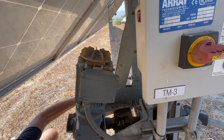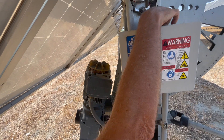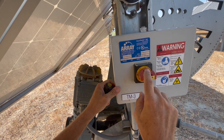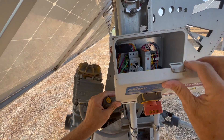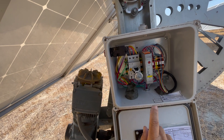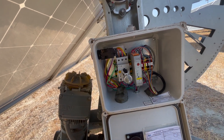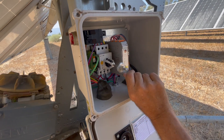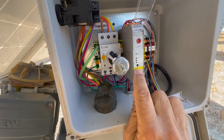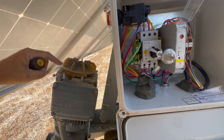So I'll leave that off. If it was amber, and if this was a stalled tracker, the next step would be to open this cover because there are some little controls inside here. It's one clip at the top and it will only open when it's turned off, so you just pop that open. This is the off-on switch right here, and in order to do this reset, the door has to be open so you can get into the button, but it also has to be turned back on. So I'm going to turn it on with my hand — the red light's on, it's got power. Then the next step is to open that little door. That little black button is the reset button. We're going to hold it in for a few seconds, and hopefully an amber light over here turns to a blinking green light.